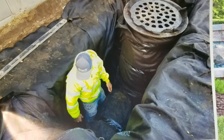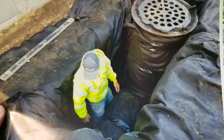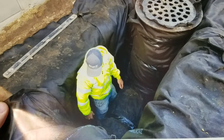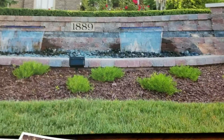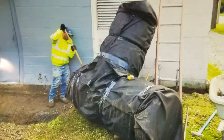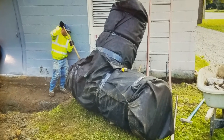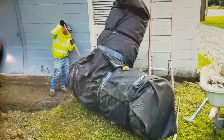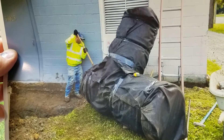There's a pump that goes all the way to the bottom of this cistern so the water can be used — to water the lawn, to wash a car. This isn't set up for drinking water. Notice the shape of the cistern: we put a false floor midway up. The pump at the bottom lets you use the water in the cistern, and then there's a second pump on the false floor.